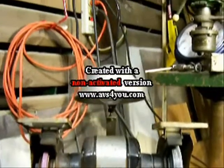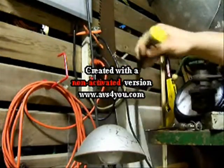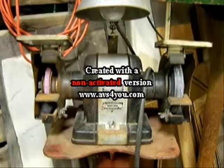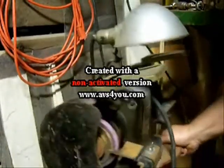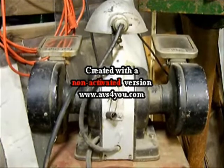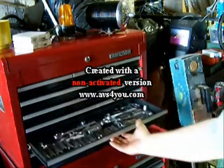Before I begin I'll need to unplug the bench grinder's power cord from the power supply. Now I'll need to turn the neat old Craftsman bench grinder around so that we can see what kind of tools we'll need to get it off the neat old pedestal. Let's take a closer look at the bolt so we can see what size tool we'll need. It looks like it's a 9/16ths to me, so I'll need to go over to the Craftsman toolbox to get the tools. A 3/8ths drive ratchet and 9/16ths long socket should do it.